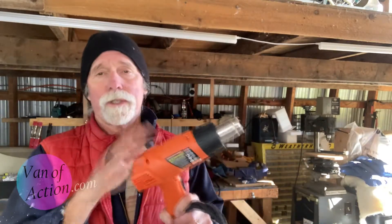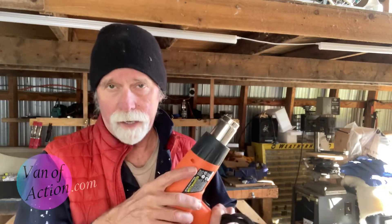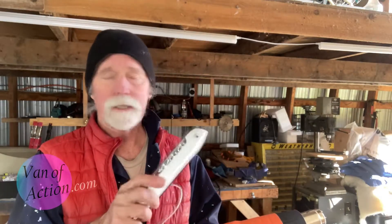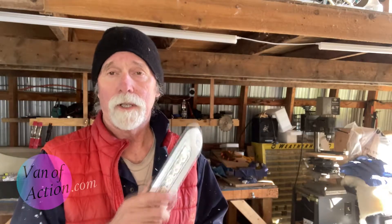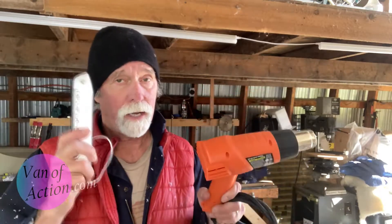This is a heat gun. Research has told us that this heat gun on a 100 amp hour battery, fully charged, will run for about a little over five hours on high. This is an LED light — on a 100 amp hour battery, fully charged, it will run this light for weeks. When you want to buy a fridge or a cooler, you can buy one that's more like a heat gun or more like an LED light. It may be to your advantage to spend more money on the cooler so you can spend less on the storage system, or vice versa.